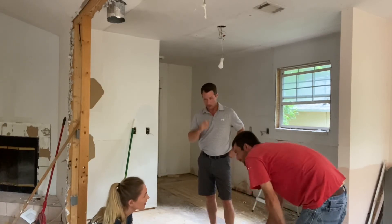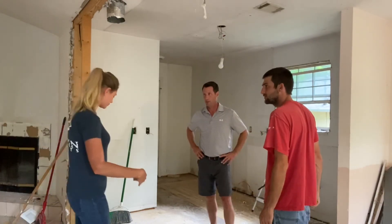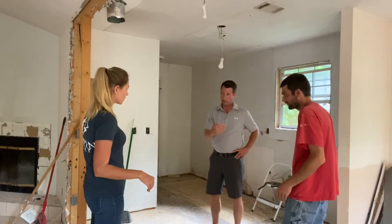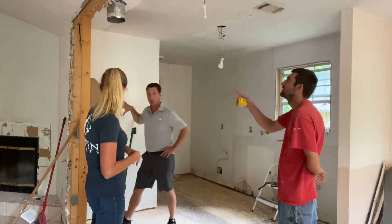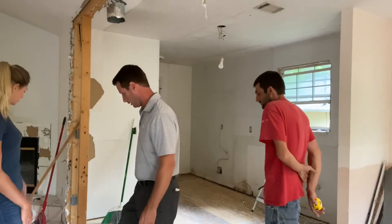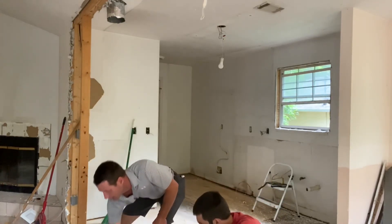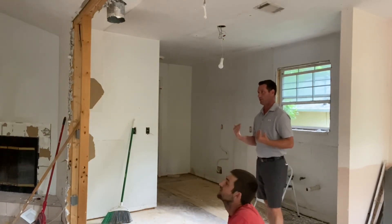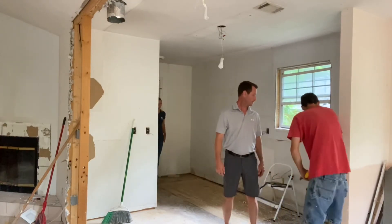Cabinets on the back of the other 15. We're trying to see if we can start the island here, or if we should start the countertop on that line. I think the bar should be right here — the end of the countertop would be here. So you're pushing it nine inches this way? No — because that's coming into your kitchen and making it feel smaller. Unless, with all this out, it's going to feel like a regular wall. So if you push the island out a little bit, if the island back lined up with this wall and your nine-inch overhang was here, that's more practical — you're not pushing it into the kitchen. It's 26 inches there, plus more because your cabinet base won't be 24 inches. So we're good.